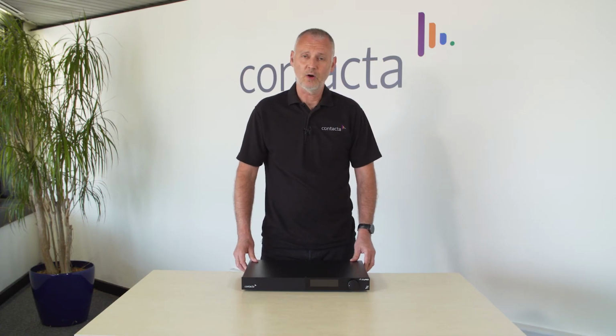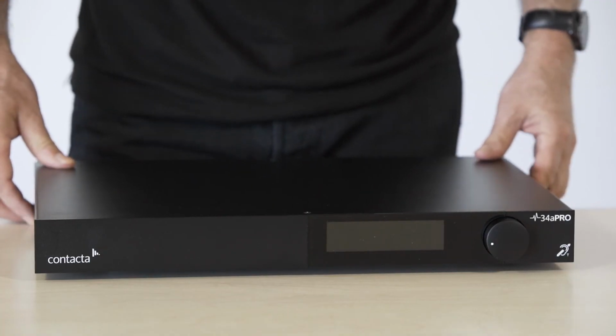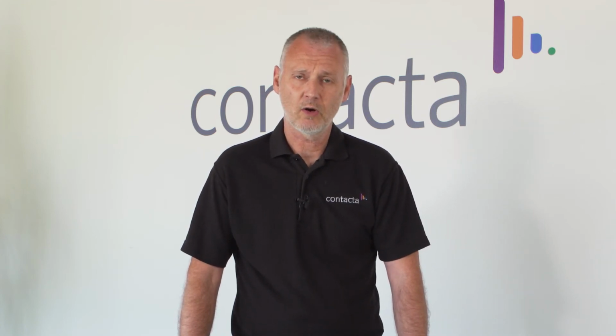The driver has a dual DSP controlled AGC with HF compensation for metal loss. There is a Class D amplifier output stage capable of delivering 12 amps RMS at 34 volts. The V34A has highly rated custom heatsinks built in with active cooling. The driver is powered by highly efficient switch mode power supplies with up to 90% efficiency with a constant current output stage. One of the newest features in the V34A Pro loop driver is audio time delay.